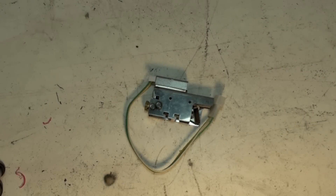This is a Carrier LH68005 pilot burner assembly. It goes on the 58SS and the Bryant Day-Night 58GP models. This is from the early 80s as an intermittent pilot, which means the pilot does not stay lit all the time — it's lit when there's a call for heat, saving a little bit of energy over keeping a standing pilot.